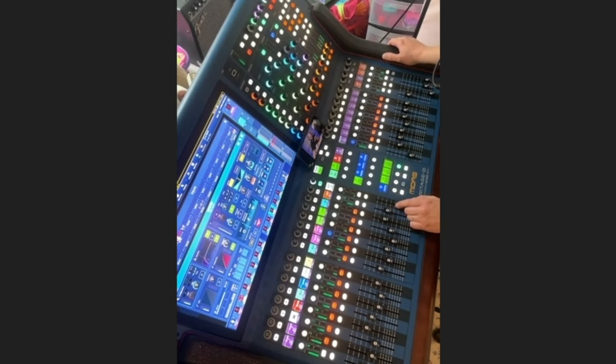You've got an HD 96 in your living room basically, and you also have a Pro 2. So you're mimicking a front-of-house and monitor situation — HD 96 out front, Pro 2 for monitors. The thing is, in my line of work we use a lot of UltraNet, P16, and AES50 at 48 kHz for DP48 and interfacing with Wings and X32. The Pro 2 doesn't have any of that.